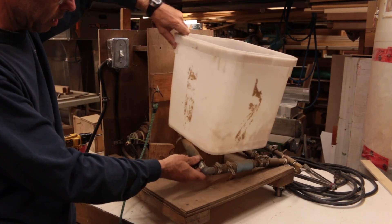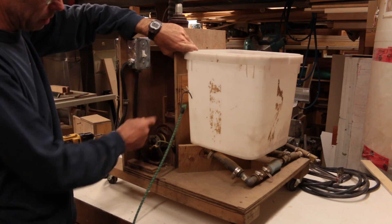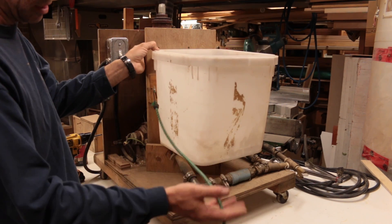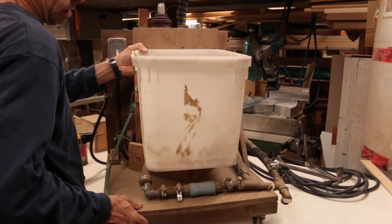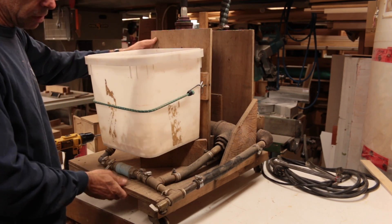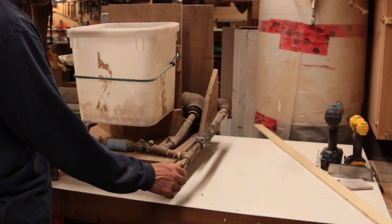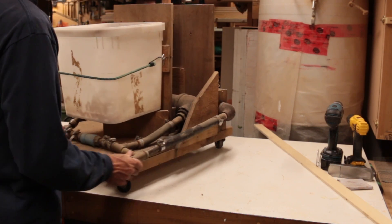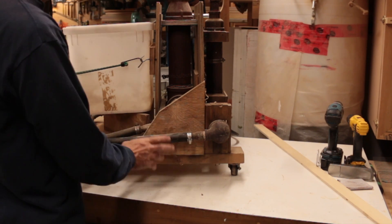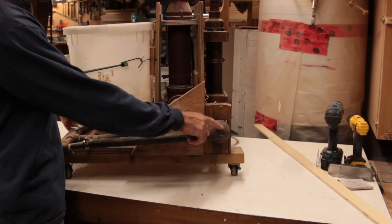I keep this bucket on a little stand, elevated, and the goal is to maintain water level above the coil. I've got it attached to a bungee cord, which allows it to dump easily. There's also a little plumbing shutoff valve just to drain the whole system when not in use. If you leave water in this, you get a lot of iron oxide building up, and depending on what kind of wood you're working with, that can stain the wood. So put fresh water in and tip it on its side to blow out all the junk.